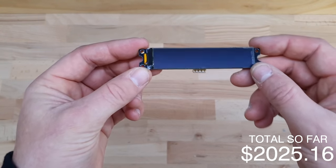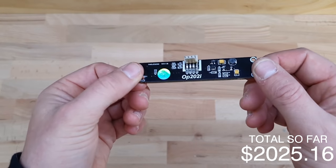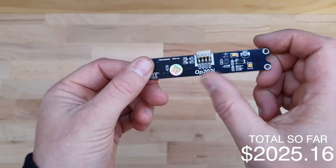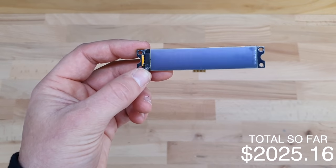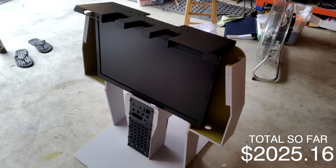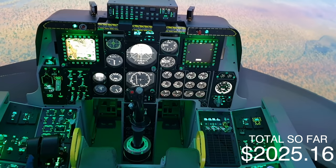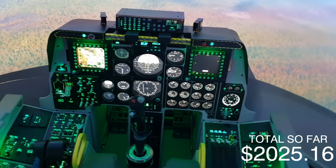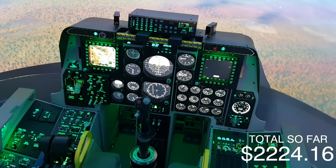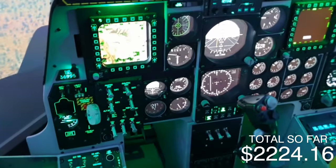Those OLEDs work really well with Arduino and are easy to program. You could use cheap 1602 LCDs but you'd need a 20-character display for proper formatting. The biggest display in the cockpit is a 27-inch LG 27MK430H LCD monitor — one of the cheapest available — at $199, which runs all the gauges and instruments behind the main instrument panel.